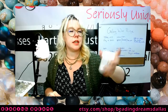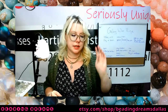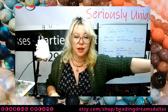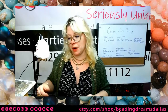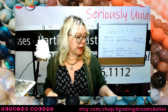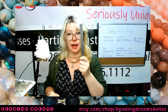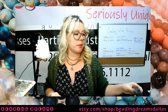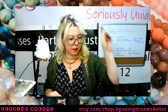You are going to need flux. All right, we'll talk about what that is and what it does when it's time for us to use it. You're going to need pickle and a pickle pot, which I have off camera. We're going to talk about that, what it is and what it does when it's time to use it. You're going to need a soldering surface. I've got my Solderite board here. Random hand tools. You're going to need a metal shears. You are going to need a file, a nice flat file, good sharp one, is going to make your job a little easier. You're going to need some fine steel wool and 320 grit sandpaper.